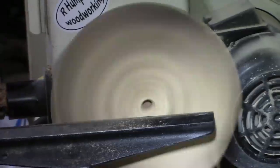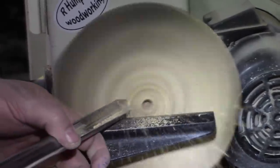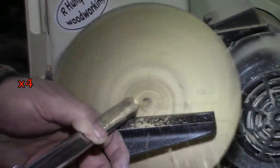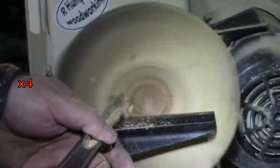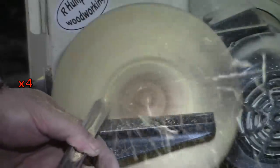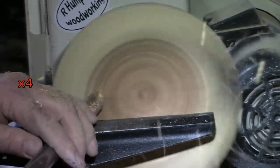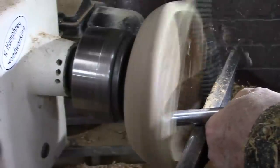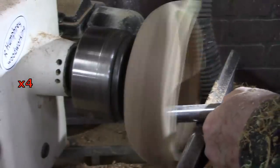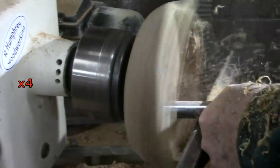To this point I was running at about 850 RPMs, and I'll do the rest of the bowl other than the sanding at 1500. This might not be the best video angle, but it does give you a look at how I ride or glide the bevel down the side of the bowl in a traditional push cut and then transition into shear scraping across the bottom of the bowl, all in one movement.